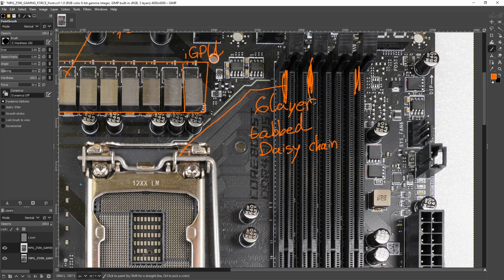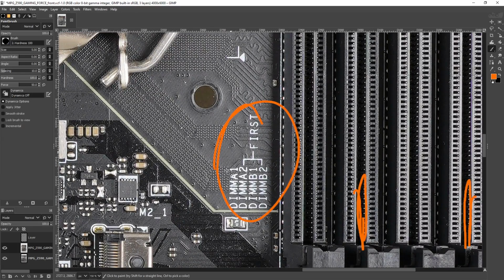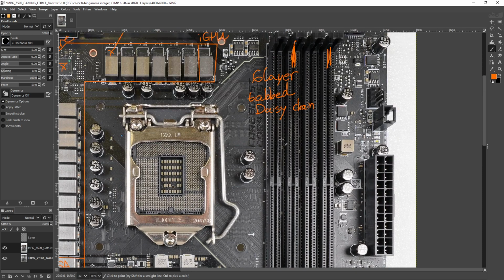And basically, if you use the wrong DIMM slots on a daisy chain, sometimes you can't even boot JEDEC settings. It's really bad for signal integrity, and so you just can't run any reasonable clocks. And that's why daisy chain motherboards will always have an indicator like this telling you to use the correct DIMM slots, because if you don't, they barely function. Now, if you have 4 memory sticks in the board, this isn't a problem anymore, because the memory sticks actually have a bunch of termination resistors on them, so that they can deal with that. So you no longer have a problem with that.